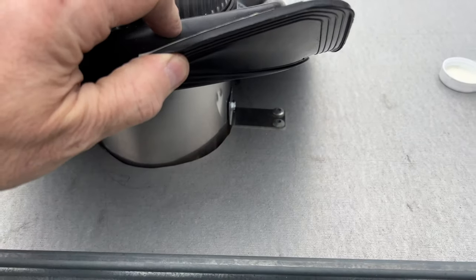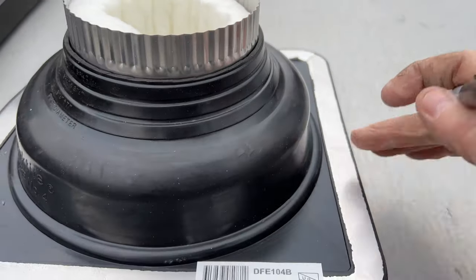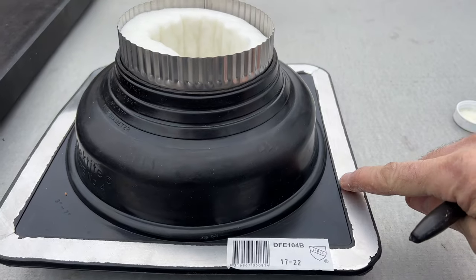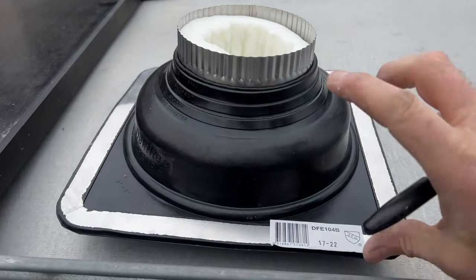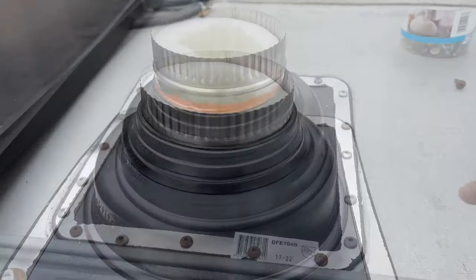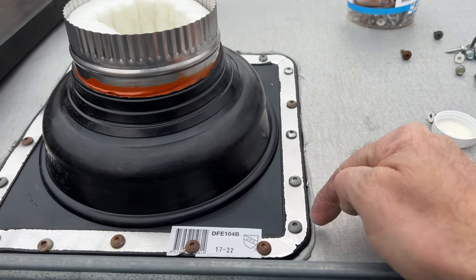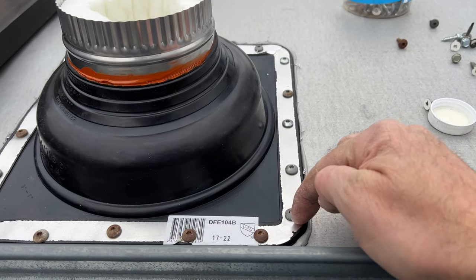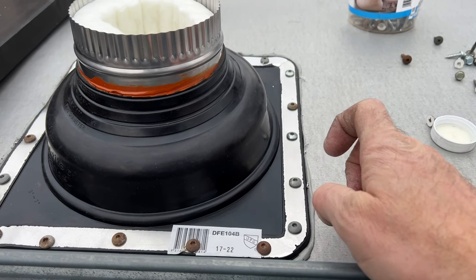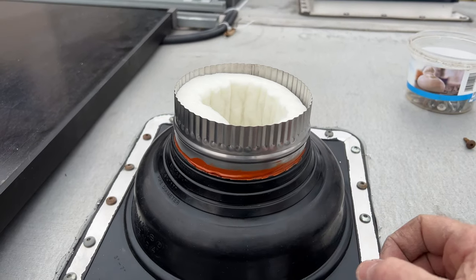I've got my brackets in there. I'll position the boot roughly where it's going to go, mark around it, then put silicone on the inside of that line, and a little high-temp on the pipe. Now it's all screwed down with a nice layer of caulking underneath. I'm putting a layer on top of each bolt head and along the seam to make sure it's really well sealed — the high-temp silicone seals the two pipes together.